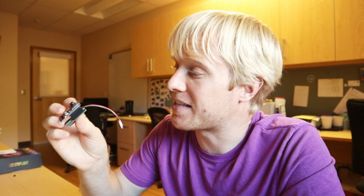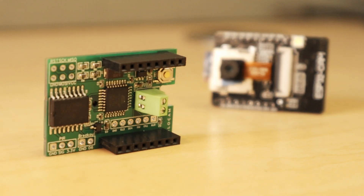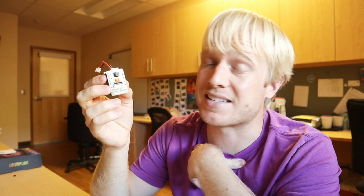So who's going to use KeloCam? Frankly, I don't know yet — this thing is brand spankin' new. But what I can tell you is that with its lower resolution camera, it's probably not going to be the same people that use CoralCam. CoralCam has a 20-megapixel camera, closer to actually like 10 megapixels, and it's really good for things like species identification or really detailed shots of organisms changing through time. KeloCam is lower resolution, but it can stay in the field for far longer than CoralCam can. It is smaller, and it is also way cheaper. This entire board — a $5 or $8 board on the front, plus what I'm hoping will cost a user about $20 for the KeloCam board — will cost you less than 30 bucks to stick out in the field, and it fits perfectly inside cheap knockoff GoPro houses you can get on Amazon for 10 bucks. KeloCam I think is going to be used for things like habitat monitoring, where you're caring about how the tides move in and out of a wetland, or things like coastal erosion — processes that take longer to occur and that you don't need super high resolution data for.